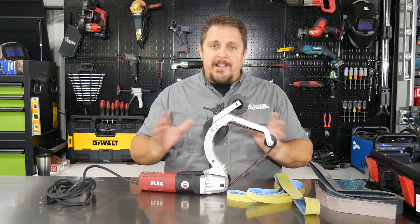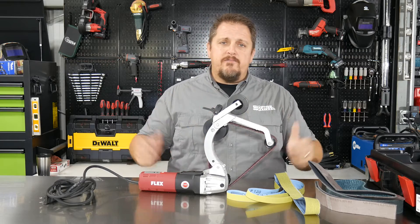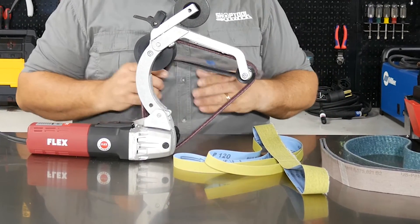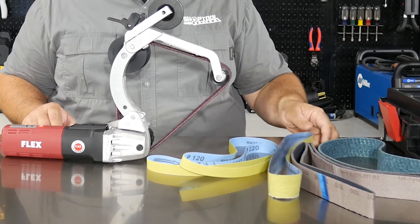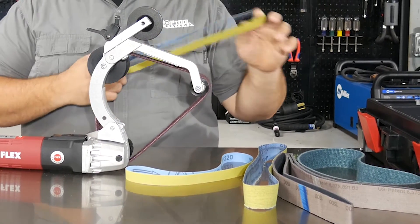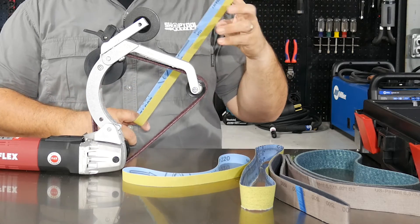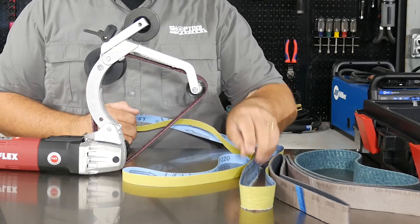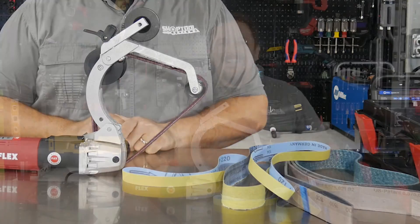AIS really liked the tool, said it had plenty of power from the one horsepower motor to cut through whatever they were using it on. You've got your choice of materials all the way up to 1500 grit, and obviously you can use whatever belts you like — but this is kind of what came in the kit. These narrower belts come in really handy on those internal elbows or internal radiuses on a 45 or 90 degree elbow, being able to polish in there without a full-size belt trying to kink up on you or not reaching those surface areas.